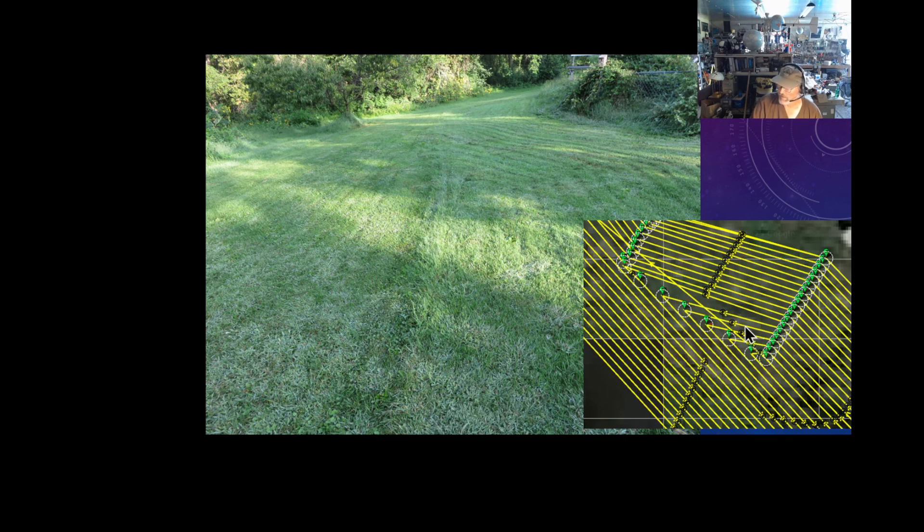This little area here corresponds to this area in the middle, where I had some gaps between the waypoints. What I'm doing now is, once I get the survey grid accepted, I go back and modify it and add some waypoints and move things around. Once you get this done, all you need to do is reload it to your mower. I've got different sections of my yard with different maps set up, so I can just say okay, I'm going to the side yard today or around the garden today. This particular mow is a pretty good size for my little 20-inch mower. Since I've been able to gang more than one electric battery — these 40-volt batteries — through ideal diodes, this is probably an hour and a half mow. I've still got some battery left using a 12-amp hour battery and a 5-amp hour battery together.